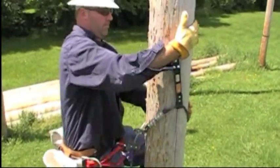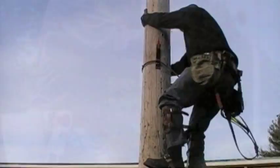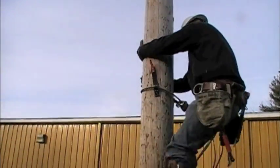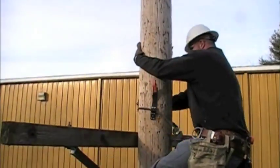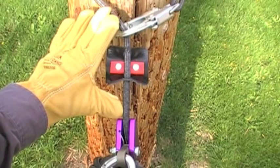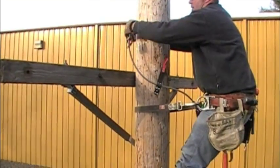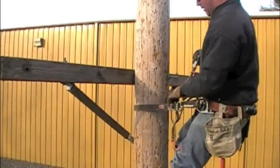When using the pole lariat, keep the device waist-high or above when climbing or descending. Proper adjustment is imperative for performance. If the pole lariat is too loose, it may not restrict your fall. The friction adjuster must be no more than six inches from the pole and the parking tab halfway between the pole and the adjuster. You may have to shorten your steps a little when you climb. Be conscious of the taper of the pole, adjusting the pole lariat as you go up.